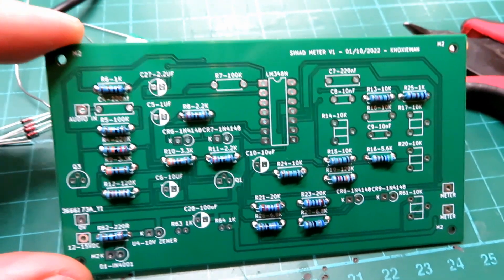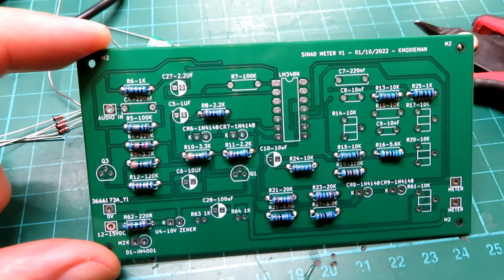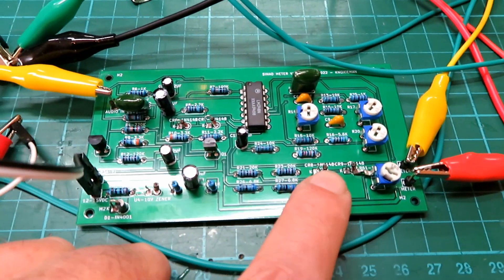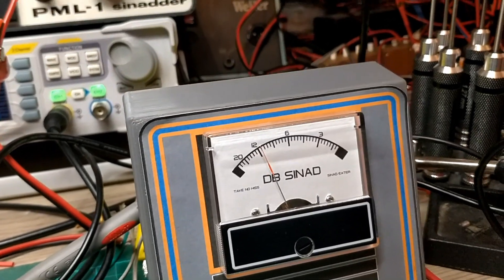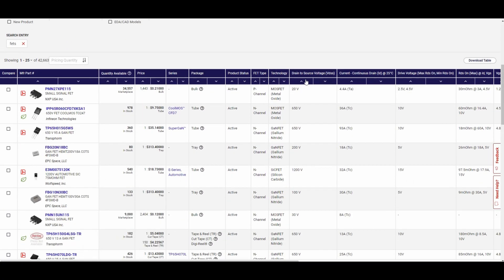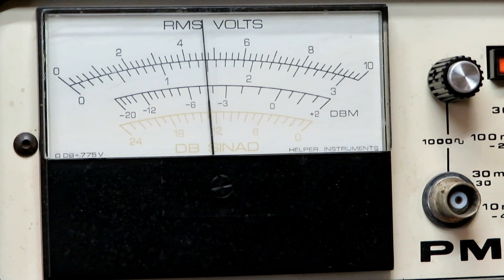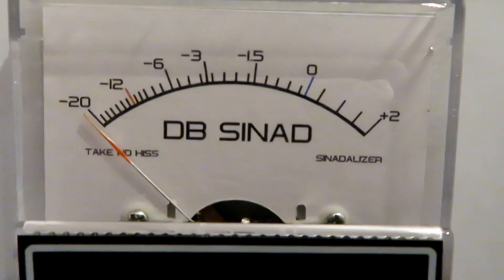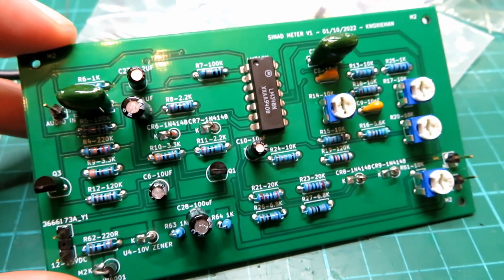Manufacture of the boards here was much more time consuming than I had first thought. I tested every single component with the TC1 before putting them into the boards. Each board took me over one and a half hours to assemble and test. Each board was tested on the scope to check the AGC function, the notch function, and the signal to noise levels. A very good thing I did too, because a batch of so-called original stock FETs were in fact subpar, so genuine ones were sourced at great expense from the manufacturer as these just have to be right. I spent a lot of time sorting the correct meter for this unit — it needs to fit a budget, so I can't go buying £150 galvanometers, but I have found meters that work great with this circuit and with a custom scale will make for great little meters that are easily and cost-effectively replaceable.